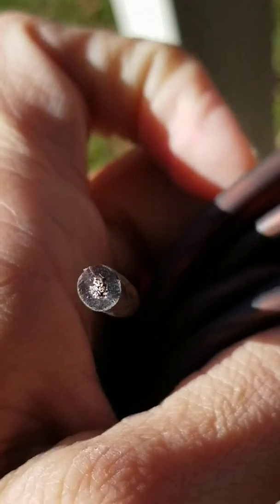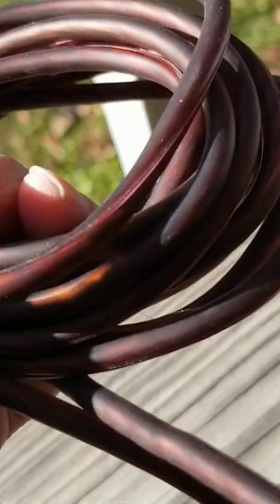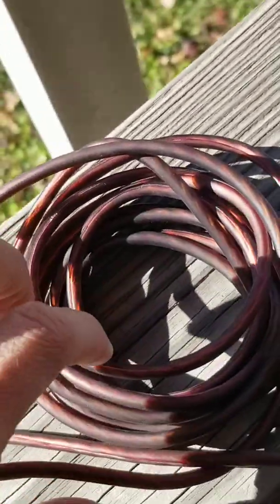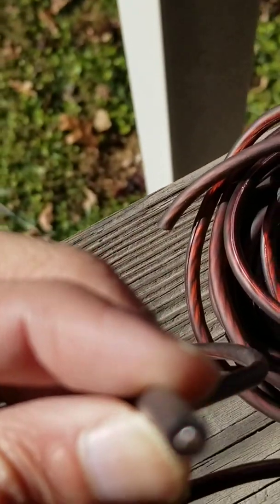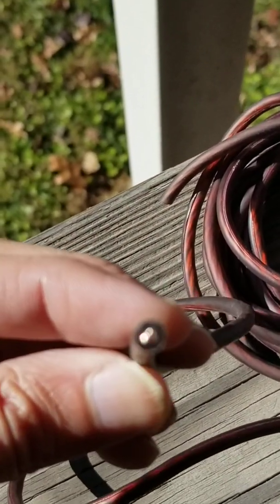You can see the ends of this — looks quite good. You usually take that off, splice it, and put it in there. It should be able to work with speaker wire. I actually tried my walkie-talkie on a speaker wire antenna in my backyard — it will transmit on 18 gauge wire. Anything like 12 gauge or 18 gauge will work, but any speaker wire as long as it's got copper in it, you're okay. If it's 12 gauge copper speaker wire it will do quite good.